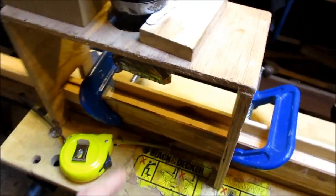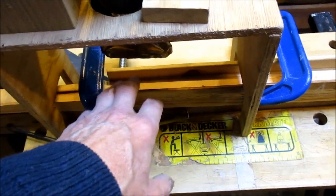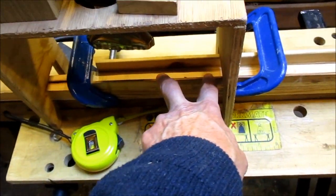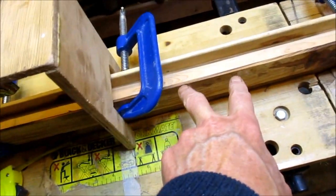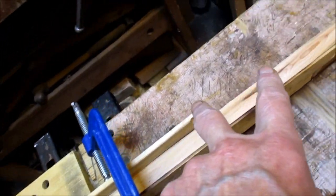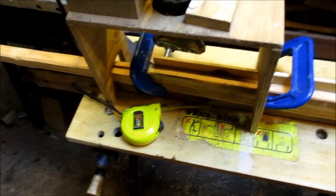I'll give it about 8 minutes at the first point, because it takes a while to heat up the wood because it's stone cold. Then I move it about that far and give it 4 minutes, and repeat, moving the cheeks along and carrying on up to the end. So you get an idea, it takes a long time, and that's just for one limb.